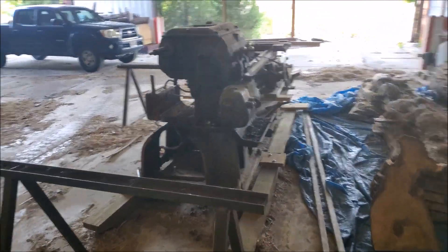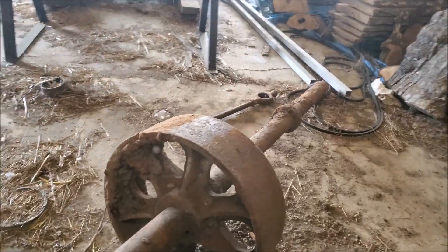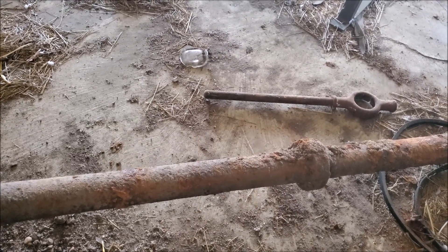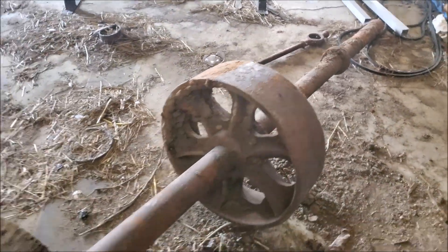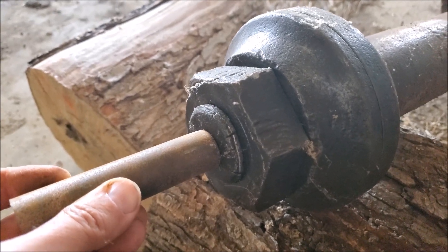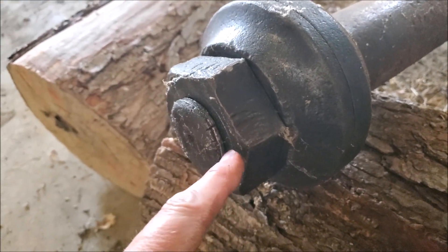So the plan is to clean up a spot near the back of the arbor with a wire brush, flap disc, or emery cloth to get a true running surface there for a steady rest. Then up at the front, I'm going to weld a piece of one inch round bar onto the nose — something for the chuck to grab — and at that point I can put a tool in and turn this nut off.